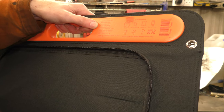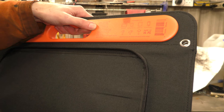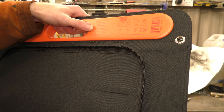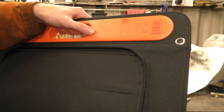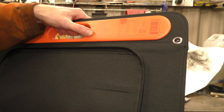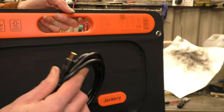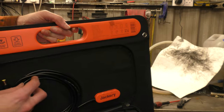Cell efficiency 23%, which is much of a muchness for solar panels. 18V output, maximum current 5.5 amps. Open circuit 21 volts. Short circuit 6.6 amps. 2.4 amps on USB-A, 3 amps on USB-C. And that is your wire that plugs straight into the power station to charge it.